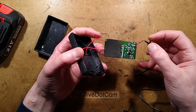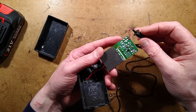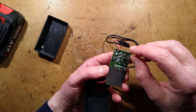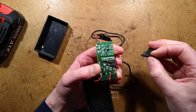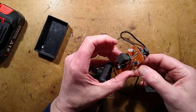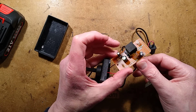It's a bigger circuit board than I expected. The output side has the transistor and a resistor — that's going to be a very hot resistor. It's literally just held in place by foam. Is there opto-isolated feedback? No, there is not. There's not even a class Y capacitor.